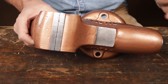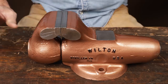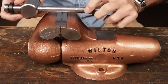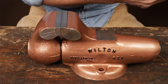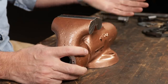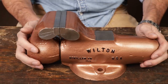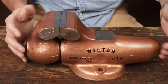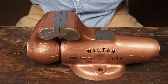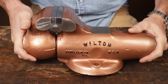It has a hammered paint finish that looks gorgeous — he did a very nice job. On the back of course there's a small anvil, and if these have been abused this will be chipped up with big dents, but this is in pristine condition. Looking at the screw, you can see there's almost no wear, and the handle hasn't really been abused. This is a swivel base model — you can get them with or without — and for gunsmithing, being able to rotate it around was really important. If you buy one without a swivel base, you can still order one from Wilton for about $150. All the parts are still available.